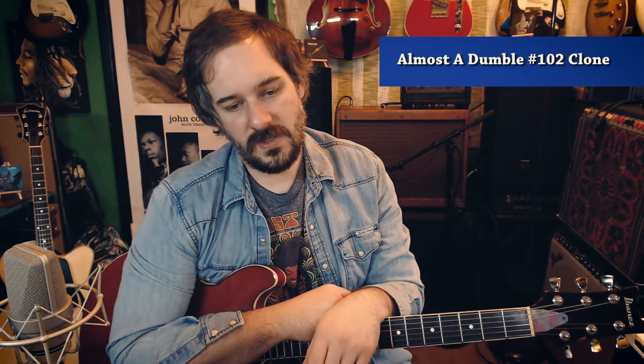The power supply on the board I used was more like a precision power supply, so the balancer is just in there - that's a slight difference from 102. I did replace the last two balance resistors with 150k because there's no FET circuit, and before that my voltages were way off. With this board I had to put that last resistor in to drop the voltage, but other than that it was pretty easy to get the voltages right just by swapping out some tubes.